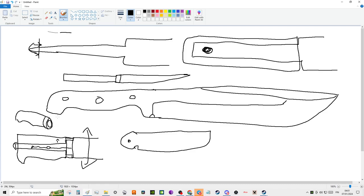So the main thing you really want to avoid is using raw wood. If you're going to do a full tang, for example, on a bowie like this or a chopper like this, you want to avoid using raw wood because when you have your material like this, it's very easy to see a split here or what you'll often see is a split come from here to there, and that can come from just batoning because this scale is being torn apart. These pins are tearing the material apart. This is not necessarily the case with more synthetic materials like micarta, right?